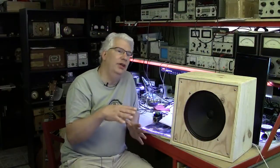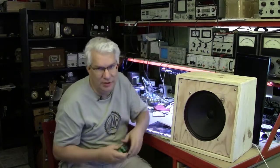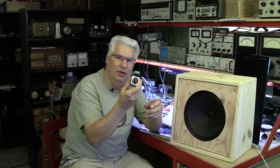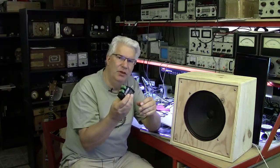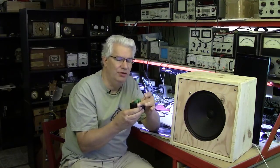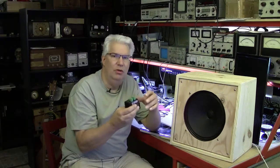So I think along this journey, there are some additional steps in the construction of the WorkBee. One of them is the motor choice. The other one is electronics. There are going to be videos about this, but I'll give you a little introduction here. I'm using this for my coil winder, and this is an integrated step servo. It's a NEMA 17, but the WorkBee wants 23s. So I ordered the NEMA 23 version of this, which is a 2 Newton meter one. It's got integrated electronics up here, and it's a stepper servo, so it will not skip steps. It will do what it has to get to the right step that you've instructed it.